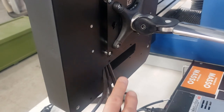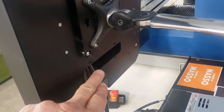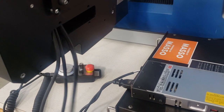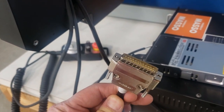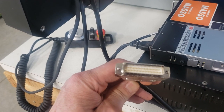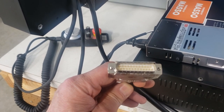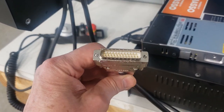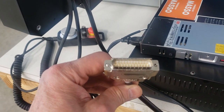The backside of the Masso has a small slot, and we've got three cables coming out of the slot. Inside the box we actually have a nice little acrylic board, and these cables are attached to that to give them a little stress relief. This cable here is our pre-produced cable that has our DB25 connector on it — all we had to do is identify what we were doing with each one of the wires. On pins 1 through 16, I went to X, Y, Z, and A motors — that took care of 16 lines. We also had limit switches: 1, 2, 3, 4, 5, 6 limit switches and a cover switch — that's 7 more. So 16 plus 7 gets us to 23. We had to run power to it, which is a 5-volt line, so actually two of the lines are 5 volts in. So we used every pin.